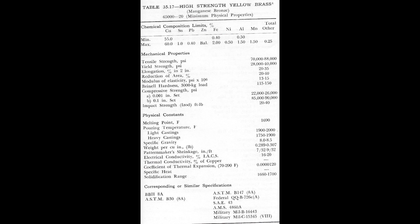Okay, high stress was put on no turbulence for a copper alloy when I was making those videos about the gating systems. Hot tops and insulated sleeves are frequently used in casting manganese bronzes for their insulating properties on the riser. Hot tops and insulated sleeves, exothermic material, something that will flame off and act as an insulator from the sand around it to keep that stuff in the riser sleeve, keep that molten for as long as they can.